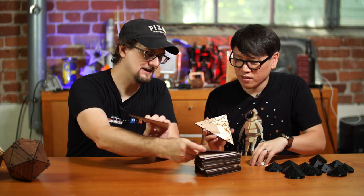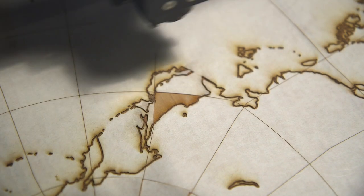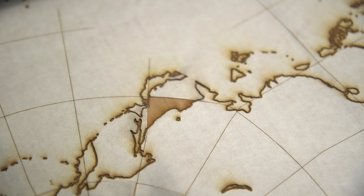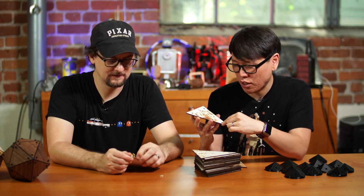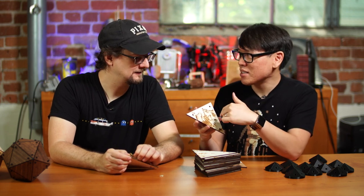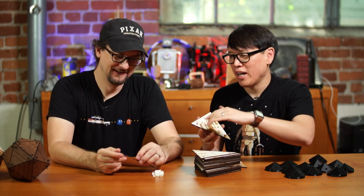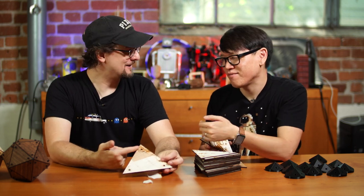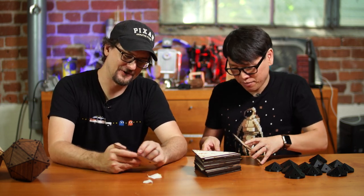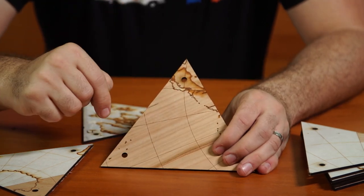I think you had a few places where it started to peel off before it got to mid cut. Yeah, exactly. Two things happened that way, right? Because there was some fine etching work here and vector etching here, as it's doing those passes, if the tackiness isn't all the way through, it will kind of float. And on that sheet specifically, you can tell there are parts. This is a great comparison though. Yes, this is showing what it gets. So this is without scorching. And that's when it is scorching.